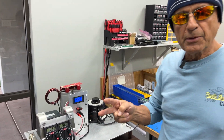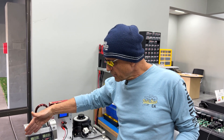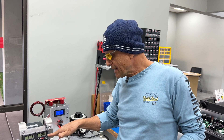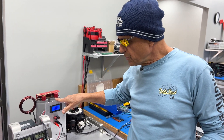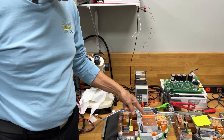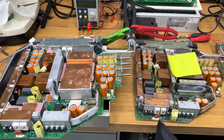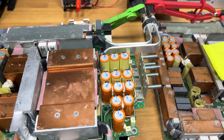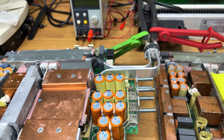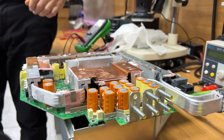This will be used in two different applications. First, to trickle charge a Roadster that has been bricked — running through these meters so we can check voltage and current while regulating the recovery. Second, directly into a DC-to-DC converter in the Tesla Roadster to simulate high-amperage 400-volt DC input and test the 12-volt outputs, allowing us to troubleshoot and simulate how the car uses this DC-to-DC converter.